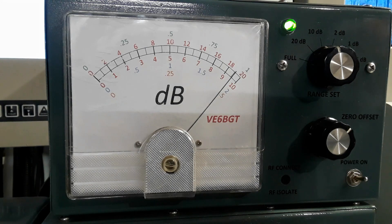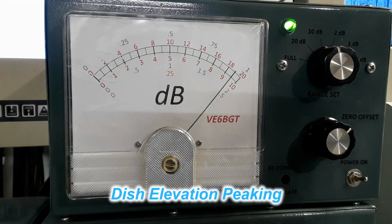This is the azimuth I'm adjusting. That's it — she's dead on the money. Put her back to where I had it — offset point, negative 0.6 degrees offset. And I'll play with the elevation. We'll go up a few decimal points. Elevation is real sensitive.